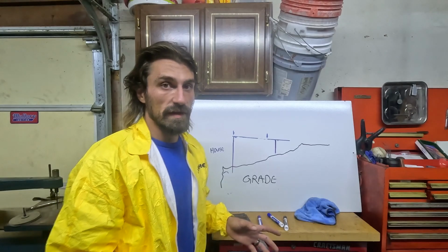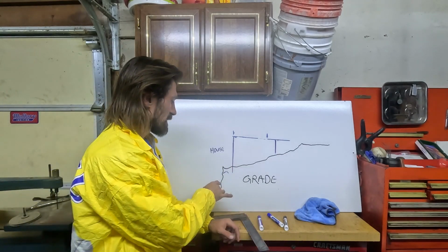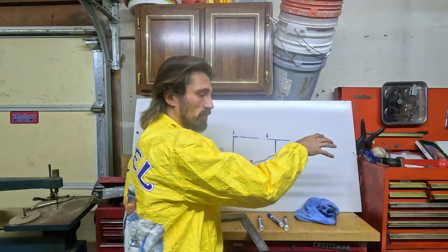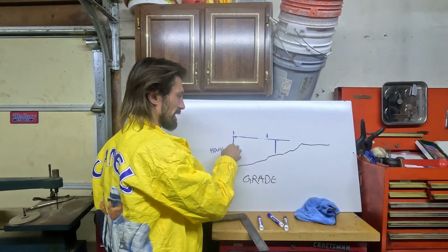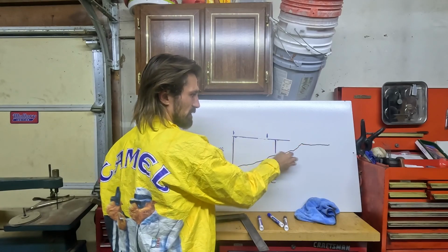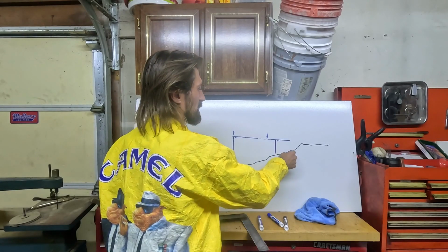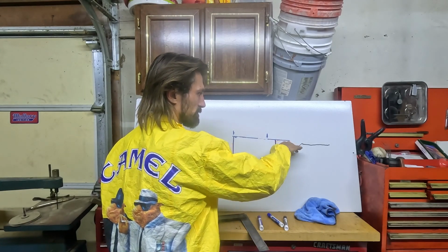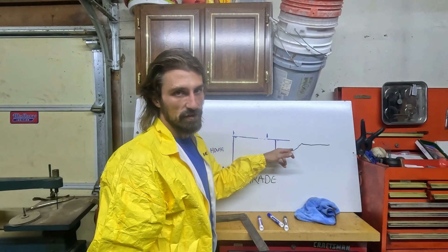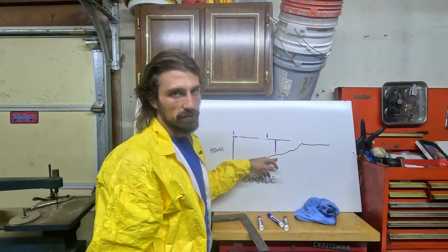All right, so another useful aspect of the cantilever, say you're building on a hillside or a cliffside, there's a massive grade that you're trying to beat. Say this is the parking area or the working area. If you do a cantilever towards the slope, that allows you to get closer to this area without having to disturb the soil that's right next to where the slope starts, and the lower headspace, headroom, whatever. If you frame up everything first to then load your piers on, digging that right there is going to be a whole lot harder than digging one back here.